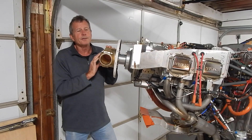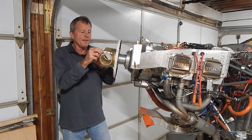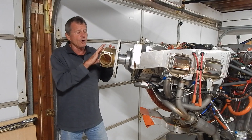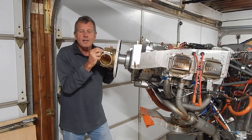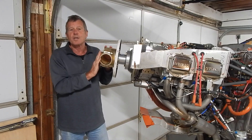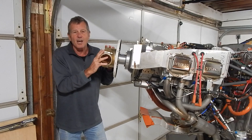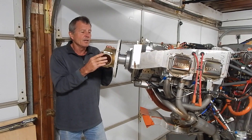The last two items seem more likely causes. First, the retention bolts on the outside are undersized — they are 3/8-inch bolts torqued to about 30 pounds. You can tell if you've got an older hub because all the bolts are 3/8-inch. Whirlwind appears to be recognizing this as an issue, as their new hub design uses 7/16-inch bolts on the outside torqued to about 40 pounds.